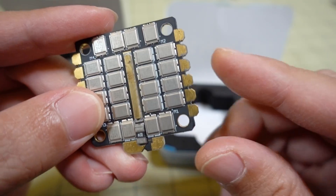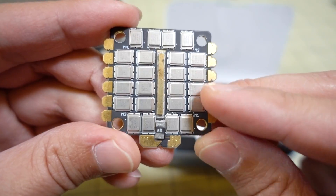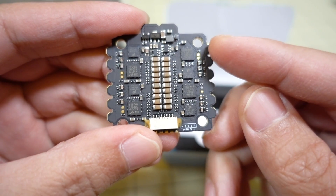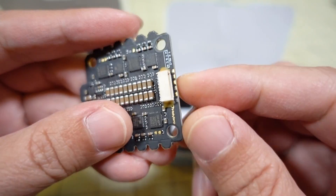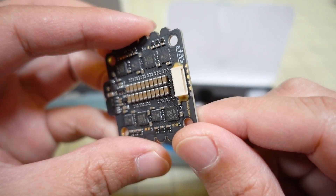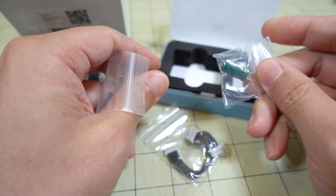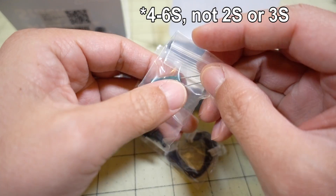There are pretty big pads for the battery leads and also for all the motor wires on the top side. Motor 1, motor 2, motor 3, and motor 4. No soldering connections on the underside. You have a huge row of capacitors for cleaning up noise, and your wiring link connection goes to your flight controller. The ESC is 2 to 6S capable — it does not do 8S.